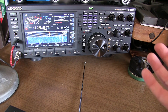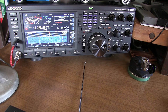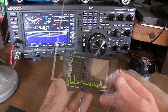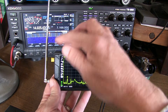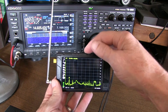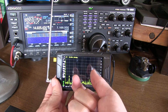To make the measurement, I'm going to switch my antenna over to a dummy load position — you can see my received signals just went away. I found that with this TinySA Ultra, if I just transmit into a dummy load, there's enough stray RF and leakage out of my coax shields to pick up pretty easily on this unit. So we'll set up this analyzer to read in zero span and make the measurement of the pulse width right on this analyzer.